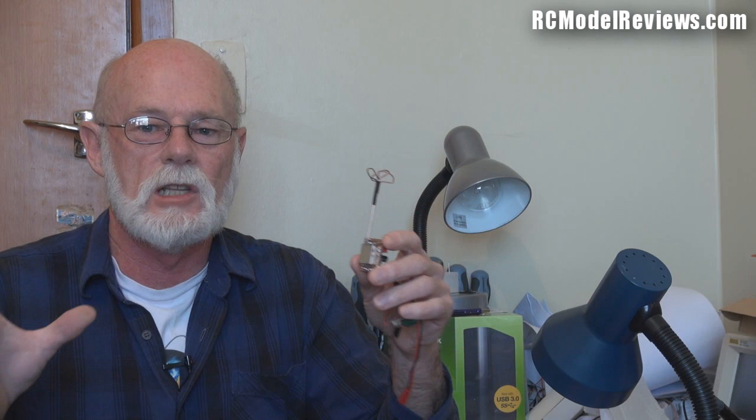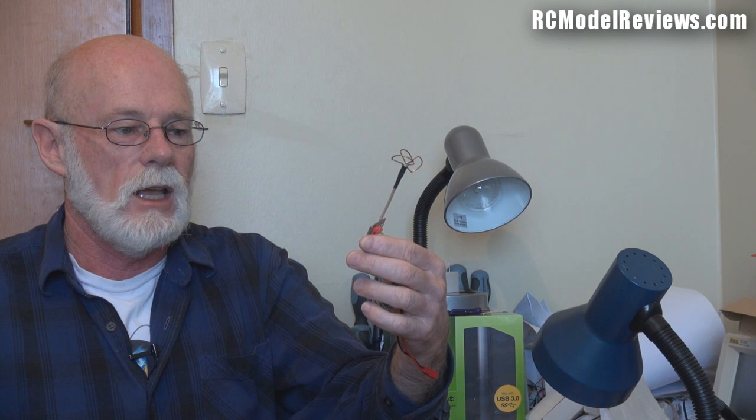High-power transmitters have more potential to interfere with other users, and a lot of people are using frequencies that aren't strictly legal. For example, in New Zealand a 900 MHz transmitter could interfere with the mobile phone system or upset pilots using DME. So you really want to keep transmitted power as low as possible. That means the better option for extended range is to use a gain antenna on the receiver.